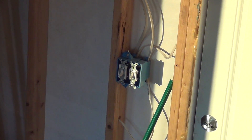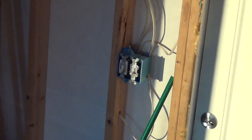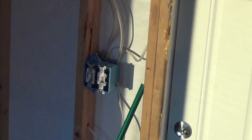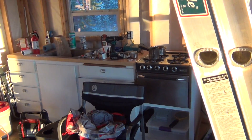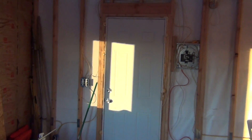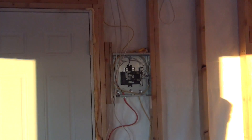There are two switches downstairs: one for the lower lights and one for the upper. The thinking is you'd turn the lower one on when you came in, and then use the three-way switch for the main lights up here. You could theoretically shut off the bottom ones, still have the top ones, climb up into the loft, and shut those off when you're ready to sleep. We're having Thanksgiving tomorrow so we won't be up to test them, but yeah — I did a lot of wiring, got all my switch wiring in.